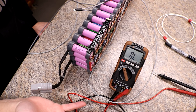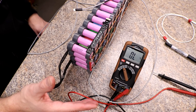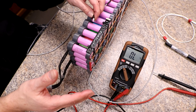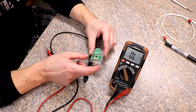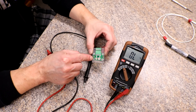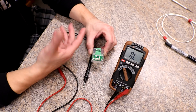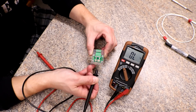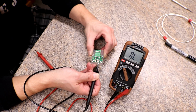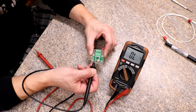The only wires I did were a couple of packs going down to the next drawer. I'll grab the little tiny connector that converts the 2-pin and 4-pin to regular wires and we can ohm that as well. This is basically what connects the LongMon plugs to wires, which I wanted to do because I always change things. The pin on this side would be the blue wire — the furthest one to the right — and then the next one would be yellow. Those would be your two data wires.